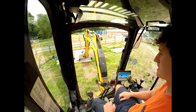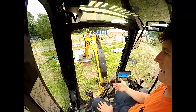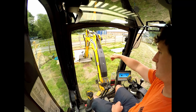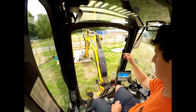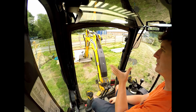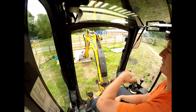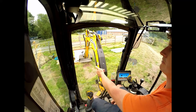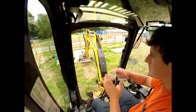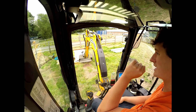As far as digging goes, it's now telling me I need to dig down 200 mil, which is dead easy, and I can follow that all the way back. Every time I dig an area I track back — the elevation of my digger changes because I'm heading downhill going backwards. I just need to find a good area I know is at the right level, reference it back to zero, and off I go. In theory you can dig like that for hundreds of meters and end up with maybe 10 mil tolerance, depending on the operator. The risk is if that reference spot is 10 mil out, you re-zero on it, and you could accumulate a height difference across a large area. For large areas you'd use the laser — re-scan every time you move and you're always at the right level.